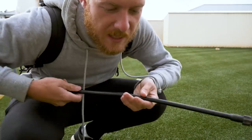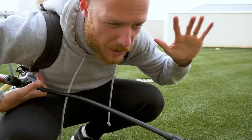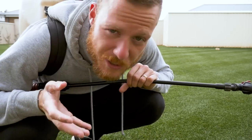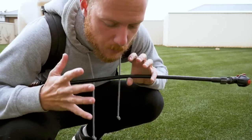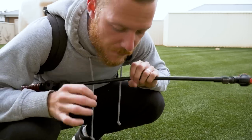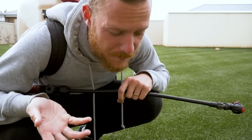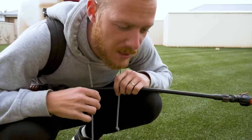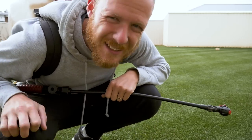Make sure you keep the nozzle at around knee height — maybe a little bit below. Don't go too close to the ground or too high, because you'll get spray drift. It's a little bit windy today — I'd recommend you don't spray when it's windy. Normally above 10 km/h, or even 5 km/h, you want to try to avoid spraying. Spray early morning; afternoons are often windy. If you have to spray in the afternoon, make sure it isn't windy because you'll get an uneven application and spray drift.